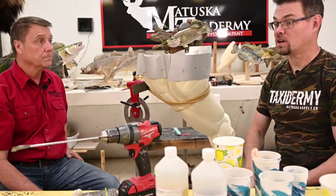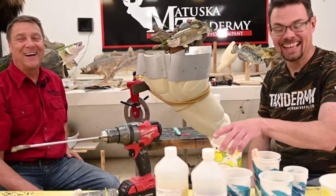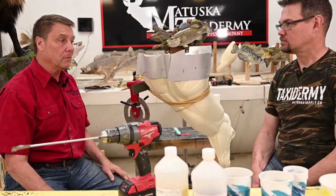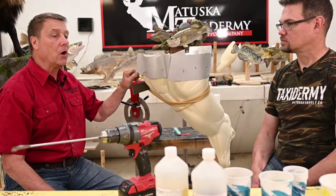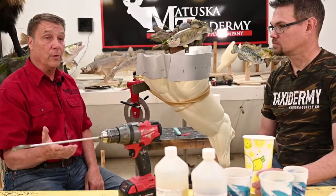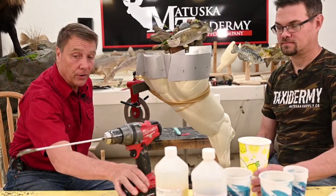So we're going to whip it with a drill. And what do they recommend when you whip your foam? How long and how fast? Pretty fast and kind of a long time. Don't go too long. I just don't know enough on RPMs. Actually, whenever we do big pours like habitat things and we're mixing things in 5-gallon buckets, we go wide open on the drill. Yeah. And we use an electric drill. As far as how long, just to get a really nice uniform butterscotch color. If you have streaks or swirls in it, keep going. Keep mixing. And a warmer temperature, especially this time of year, is going to go faster than slow. So watch it. When it starts rising, make sure you dump it.